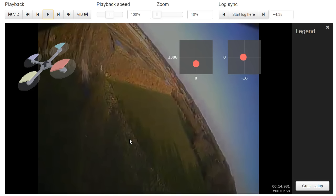So if you have a copter that has very little noise, but then you crank the D gains to the roof, the D term will amplify the noise and the PID sum will be kind of twitchy, as if you had too much noise. So those are the first two things I think about from a tuning perspective when I see stuff like this. Okay, what else do I think about for when I see stuff like this?